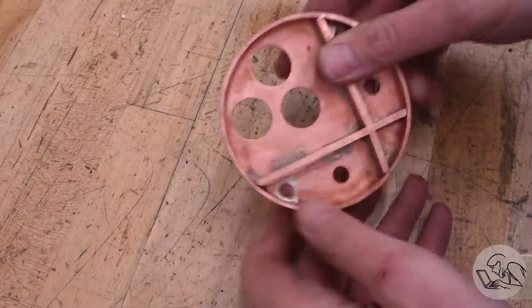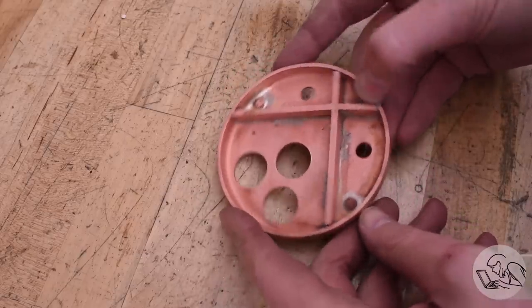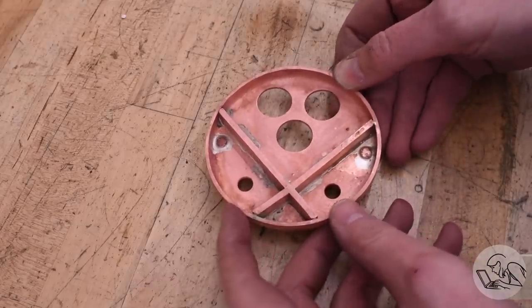If you're not 100% confident in any joint, once again at this stage, you have to do it again, because later on, many of these joints will be inaccessible from the back as the boiler gets more and more assembled, and it will become nearly impossible to fix them.